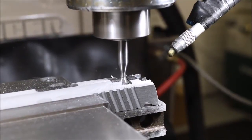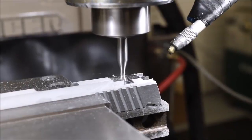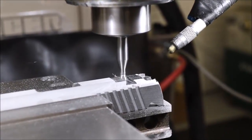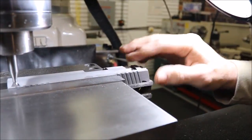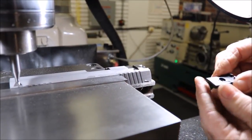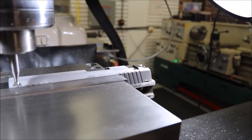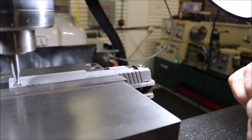As you can see, that's a pretty good cut for a dovetail cutter. That's why we cut the initial slot and remove a lot of the material — to take the stress and strain off of the cutter. So we finished the cut and I got a little bit of the whiskers, the little burrs, off of it. But now we're going to try the sight. Now these dovetail sights aren't like a lot of the press-in type dovetail sights that you have on some of the factory guns.